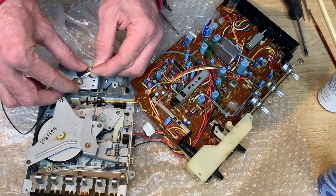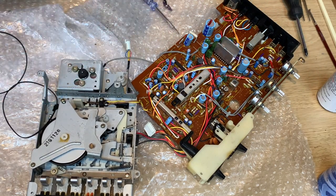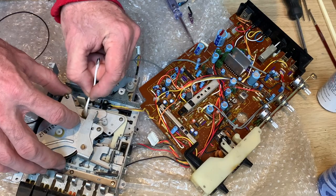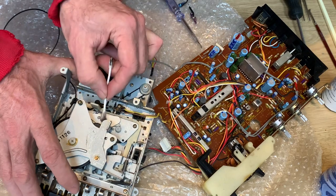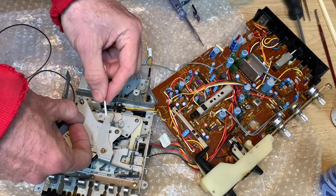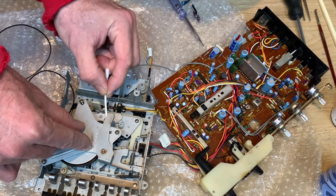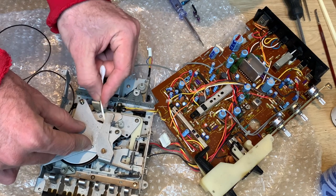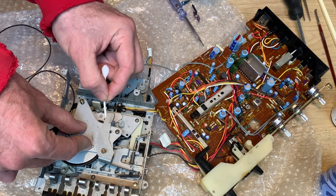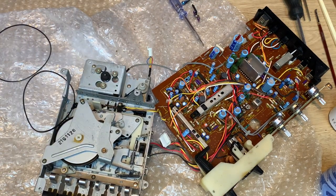We'll do the same again just on the actual motor pulley now. There's a bit of gunk on there. A bit more on the idler tyre - the idler tyre, you might not be able to see very well, I can just about get to it underneath. A tiny little bit of rubber renew there - just seeing if we can rejuvenate the whole thing a little bit. It's not a complete and utter teardown video today. There are going to be things coming up on the channel so do subscribe if you haven't already. We've got some old JVC M70s, there's an M50 and an M60 that need completely gutting and redoing.